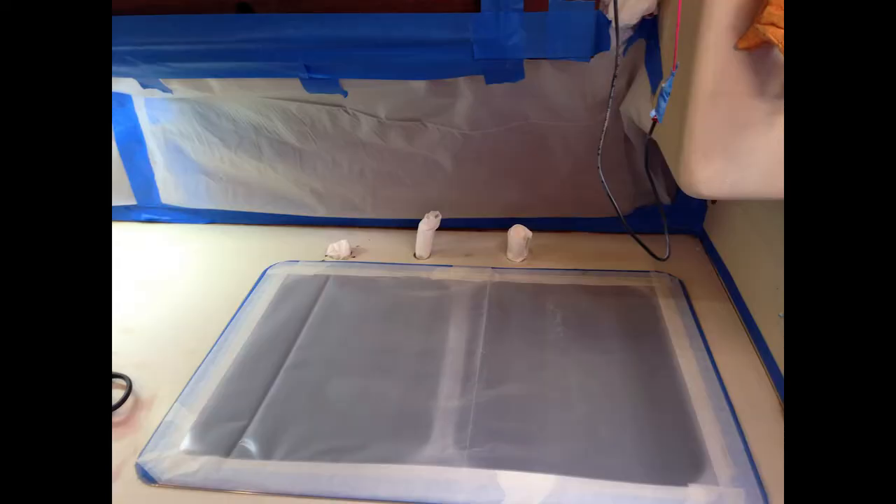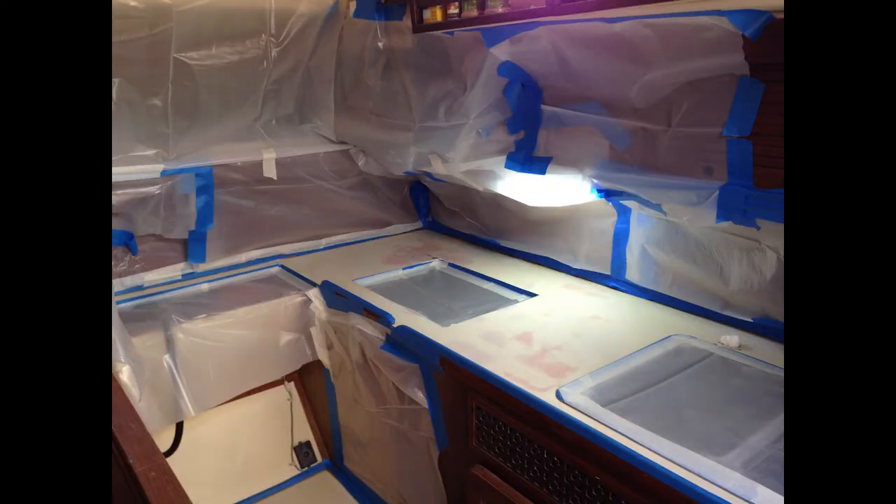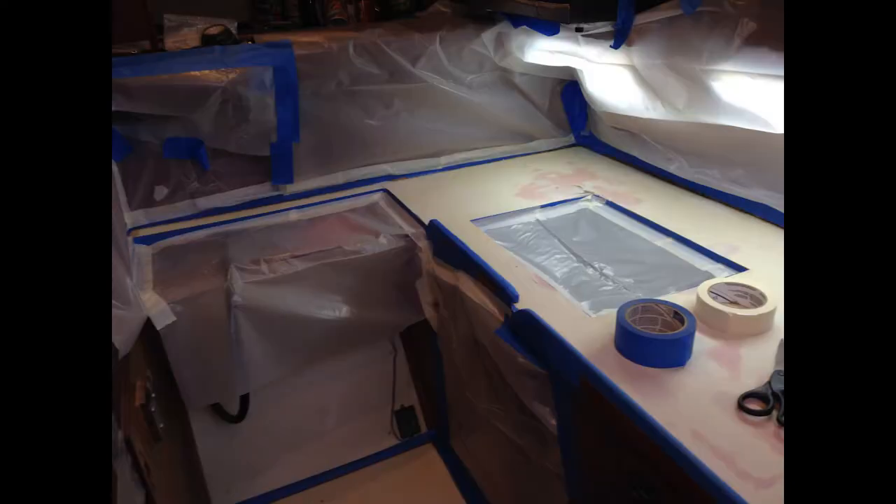As I mentioned earlier, I decided to leave the sink in. So what I did was I taped around the edge of the sink, just a little bit off the countertop height — about an eighth of an inch — and then put 30 mil poly over the top of it, which you see here. The openings for the existing sink hardware I just plugged up. Next, I used that same 30 mil poly to close up the openings from the icebox and the pot storage. I also used it as a protective layer over the cabinetry and any area where the clear coat epoxy would flow off the top of the counter, and I also protected the floor. I also protected the backside of the fiddles on the countertop so that I could keep them a nice wood finish. Here you see the finished protection ready to go.